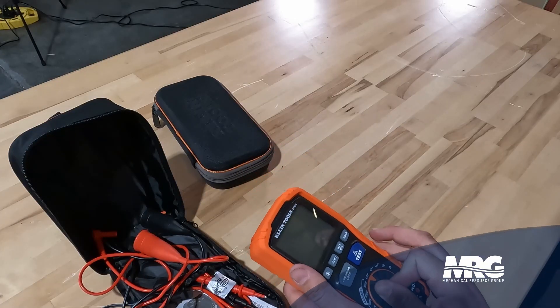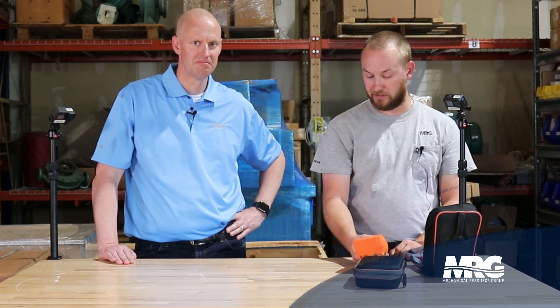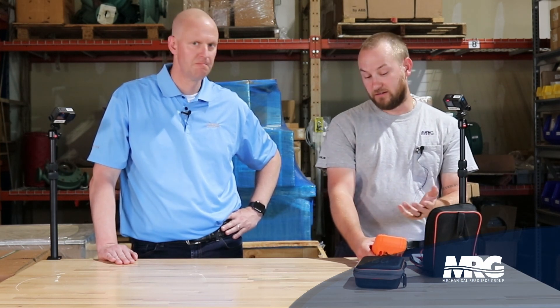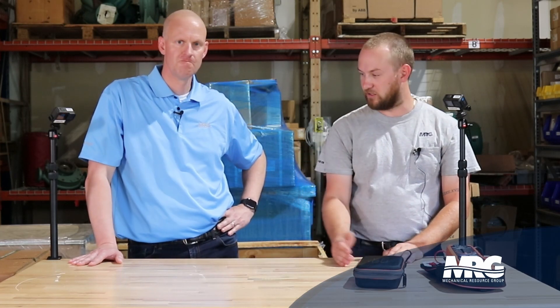Honestly, get one — I can't express that enough. Get one. As our technicians need them here, this is exactly what they're getting. You can't beat it. Just get it, practice it, play with it, get familiar with it. Once you're familiar with it, you won't know how you lived without it before. Just this week I've used it twice and on two occasions found nicked wiring in conduit, where the other Christmas tree meter might have told us the motor's bad. But we get an accurate reading using this. You can start breaking down your wiring segments, isolating your motors and things like that, and find where the short truly is — identify if it's in a single wire.